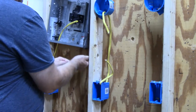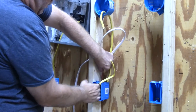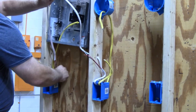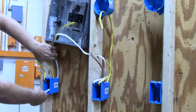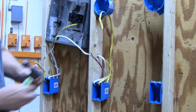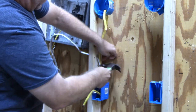Let me run it through this hole right here and feed the three-wire into the box. Leave about a foot of wire sticking out of the box. On this side I'm going to run three-wire into this box and also leave about a foot sticking out. Put a couple of staples in here to keep the wires in place. Code says you need to have a staple within six inches of the box.